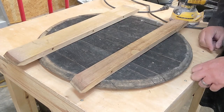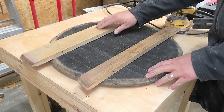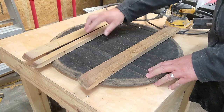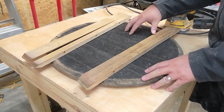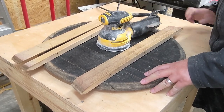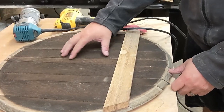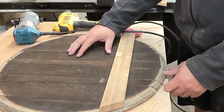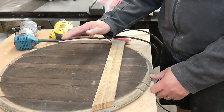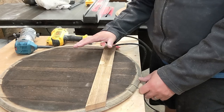Next I need to sand this shelf piece. I don't want to sand it so much that I take the patina away and leave the white oak looking normal — I want to leave some of that patina so it has character. I'll work my way up to about 120 grit and take my time. One thing to note is I had to do a lot of hand sanding since nothing's perfectly flat with barrel stuff — it's all got curves, bends, twists, and warps.